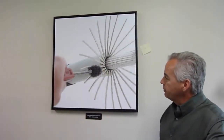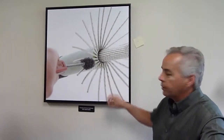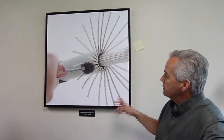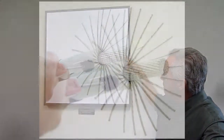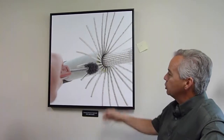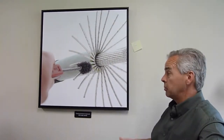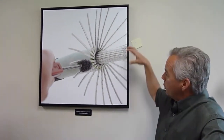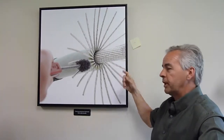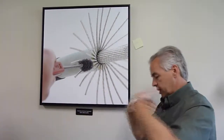So in this photograph, an engineer is meticulously removing this white and black powder off the strands of this aluminum cable. And it's a very challenging task because each one of these strands has to be individually splayed out into this arrangement, and then you have to use sandpaper, or in this case a sort of a wire brush, to get all of that stuff off. Because aluminum oxide, and most of it's aluminum hydroxide, is non-conductive, and it coats the surface of these aluminum conductive strands. And then when you go to crimp onto this or swage onto it, the electricity has to go from the innermost strands through the outermost strands into the aluminum barrel and then get transmitted further down.